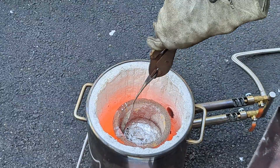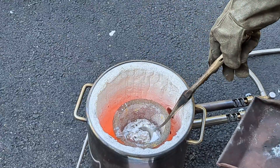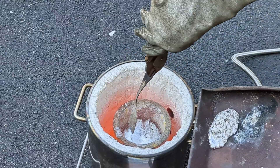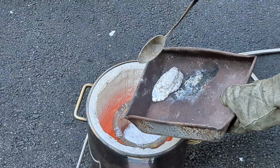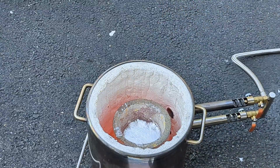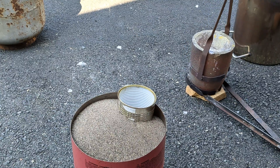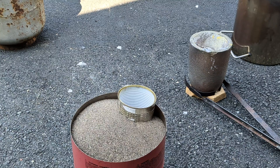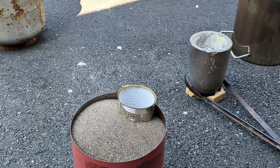Now that I have enough aluminum to cast, I'm going to remove the slag from the top of the molten metal out of the crucible — I always do this before pouring. And this is where the magic happens: you pour the molten metal into the mold you previously made and it vaporizes the foam and takes its shape. It really is fascinating — it's a super simple way to really get into learning how to metal cast.